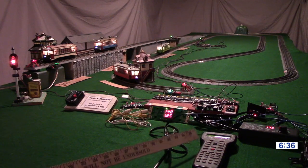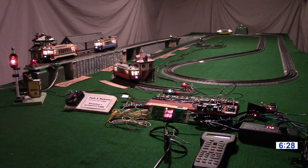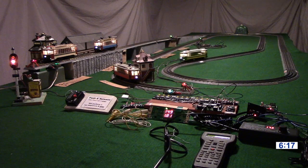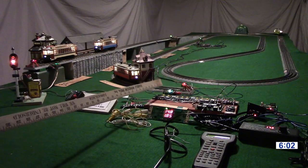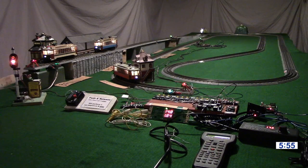As a workaround, we're using the Power Cab and a generic booster. With that Power Cab and that generic booster, we can get our voltage up higher and run these cars. I tried running the trolleys with the Power Cab only, but with the Power Cab only we could only run two cars maximum — just barely — and we had to disconnect all four of the lights: the bumper and track connector lights on each end, plus the status light. But with the booster we can run the four cars successfully.